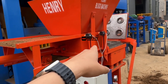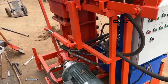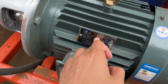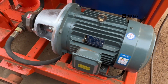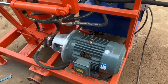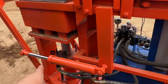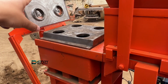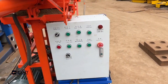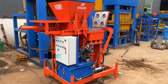For the feeding material, spreading the material is powered by this hydraulic cylinder. In order to equip this particular machine, we enlarged the rated power of the electric motor to 5.5 kilowatts. The regular rated power of this electric motor is only 2.2 kilowatts, but now it's 5.5. This hydraulic cylinder can push and pull the mold shaft. You can feel how strong and solid this machine is for producing compressed earth interlocking soil bricks.